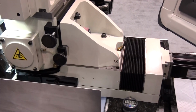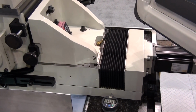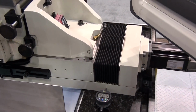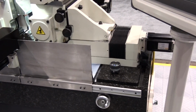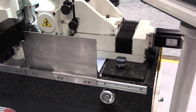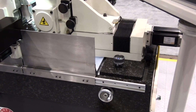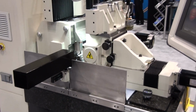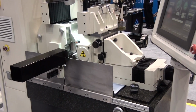With our high accuracy machine controls and ram bed positioning options, the upper ram travels over frictionless cross roller ways for the smoothest, most efficient and accurate movement. The friction-free ram system, coupled with a direct coupled motor and ball screw, allows for precision micron movement. The movement is referenced directly from the 1.1 micron glass scale linear encoder. The ball screw and direct coupled servo motor is controlled by a Parker motion control ETL system to deliver fine ram bed position adjustments when in-feed and through-feed grinding. The entire ram bed swivels with a work rest holder to simplify adjustments and changeovers.